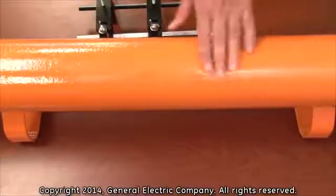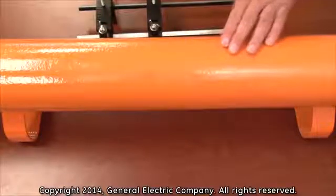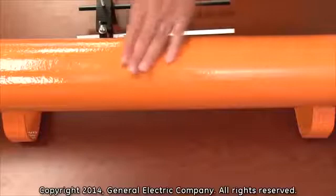The location of the installation should be clean, flat, and free of any debris or buildup of corrosion or pits. This is to ensure a good coupling of the transducers to the material of the pipe and provide for better sound propagation of the ultrasonic signal.